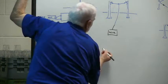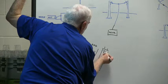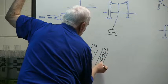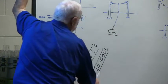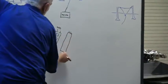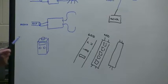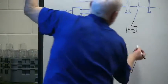The second type of transmission line that's common. Anybody want to guess what this is? Ladder line, sometimes called window line, sometimes called ladder line. You've got two conductors, probably an inch or a little over an inch apart. They're held apart by molded plastic with little slots cut in. It's 450 ohms. The third came about in the late 1940s with television, sometimes called television twinlead. Its impedance is 300 ohms.